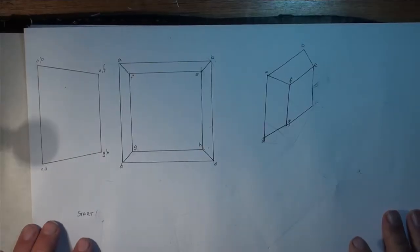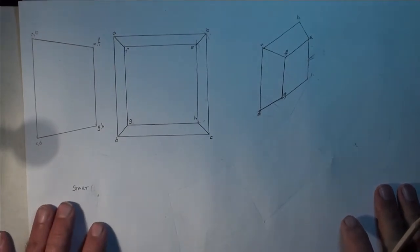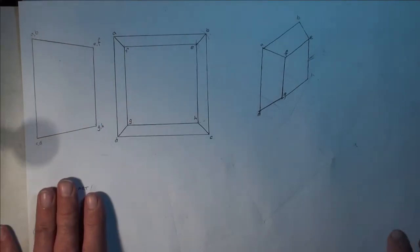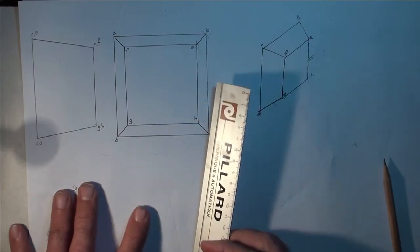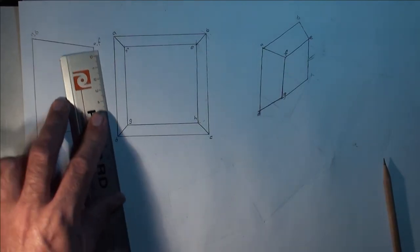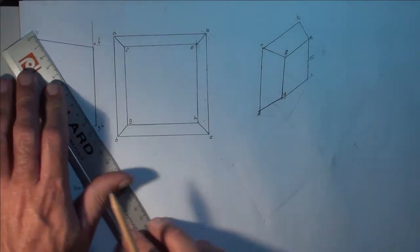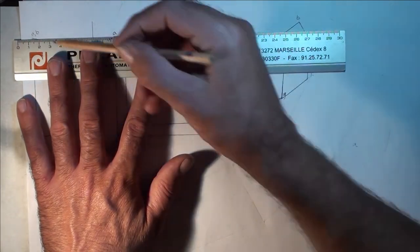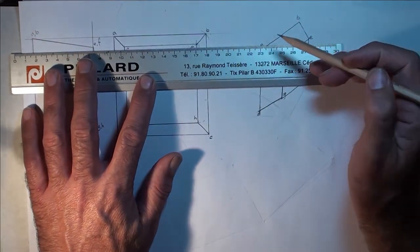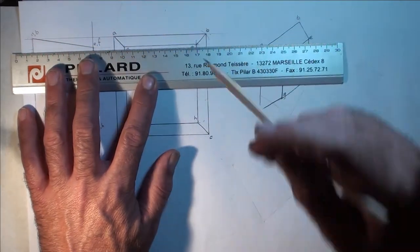Okay, I'm just doing this for the fifth time, I think. Eventually I'll get the video right. The drawing's been accurate, but the video, however, hasn't. So, fingers crossed this one works. First thing I'll do, I'm just working up on here, I'll set the compasses to correct length again. So over here, I'm just extending the straight lines across. That's going point A to point A, that's going point A to point E, like so.